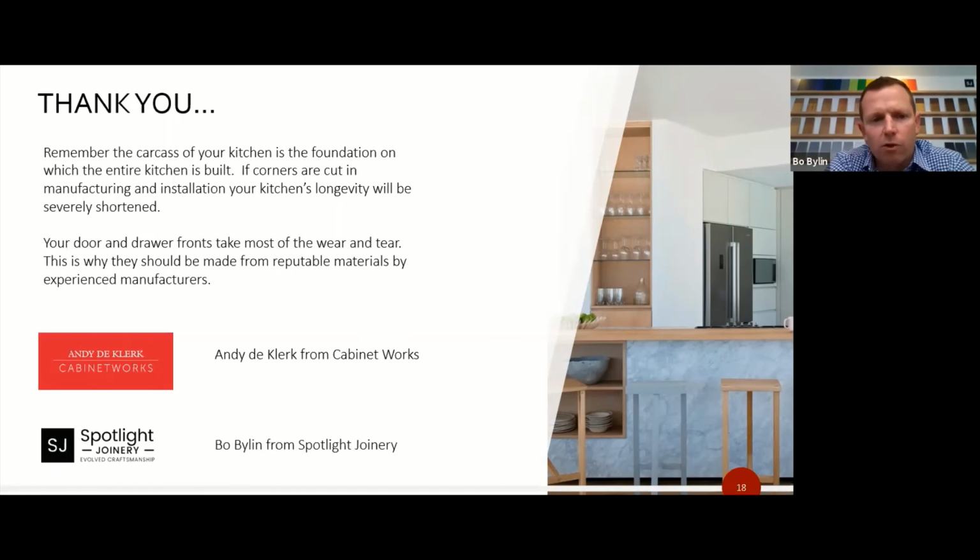Generally, for us, we use a very high quality paint. We use high body primers, and at the moment we are still on a catalyst-based paint with thinners, and we add hardener to that as well. We find that every time we spray a coat on the two flat faces of the door, we generally spray the edges again. So your edges will generally get double the amount of coats as the two flat faces of your joinery.